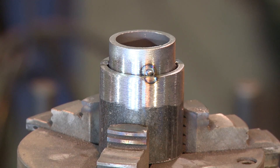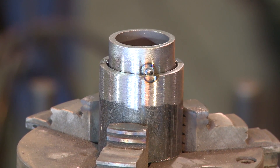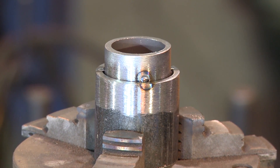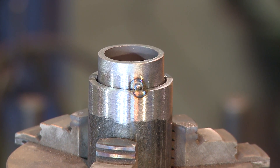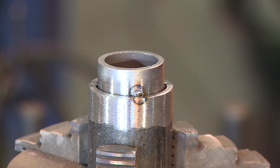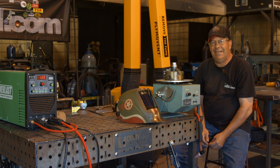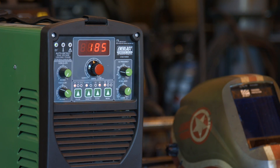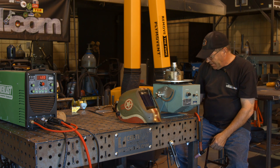I know he's going to have a tighter fit. His parts are always perfect and it makes me nervous to weld on them. We're going to do a rolly weld on a small fillet, shoot pictures and send him some stuff to see if we want to do a production run so we know how to bid this on a government-type deal. I'm going to be using E3 tungsten, running off an Everlast with the machine set at 120 amps — I want to start and hit it quick, backing off the foot pedal some.